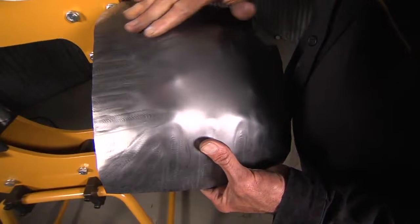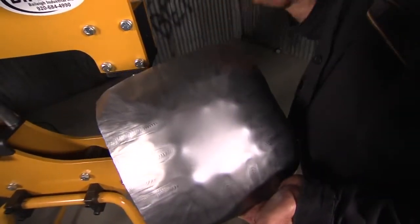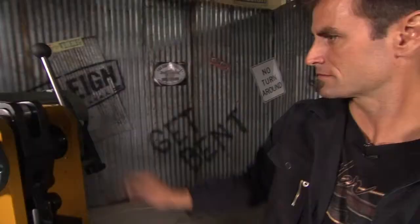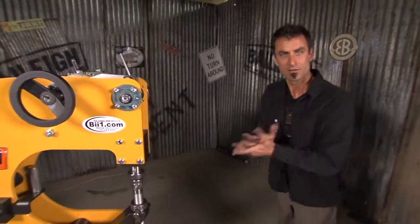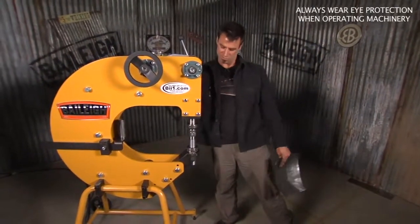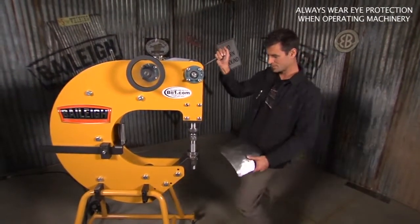We did a lot of shrinking with a thumbnail die. They've got a nice little small thumbnail die. It uses all the same dies that they use on their big multi-hammer. So at that point, let's show you some doming, and I think after that maybe we'll show you some beading. So you just flip on the switch, pull it up just for giggles.